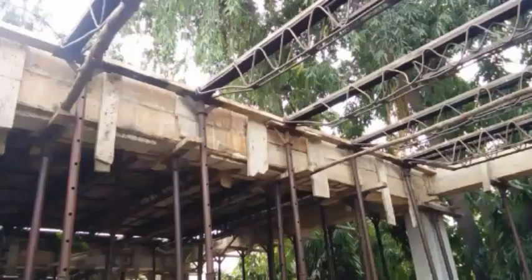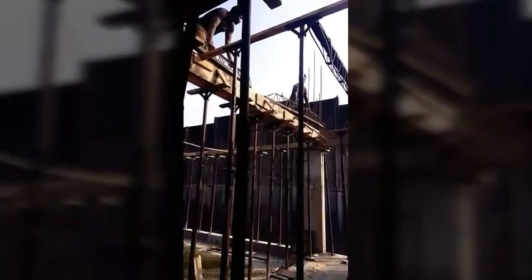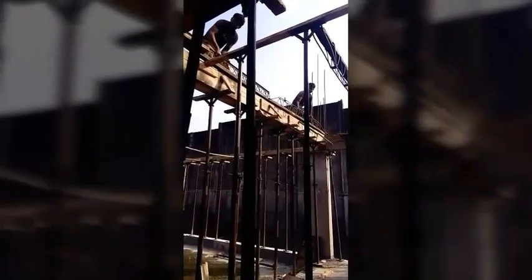Once the jockeys are positioned, wood planks are kept above it so that the acro span can be fitted to it by nailing. Same procedure is followed on the opposite side and the acro spans are laid on them. In this video, the two acro spans are interconnected as one and are extended based on the room size.